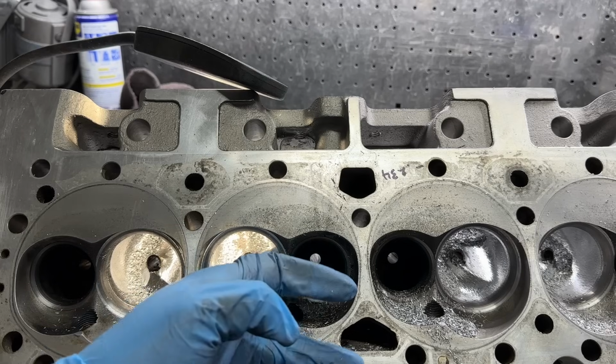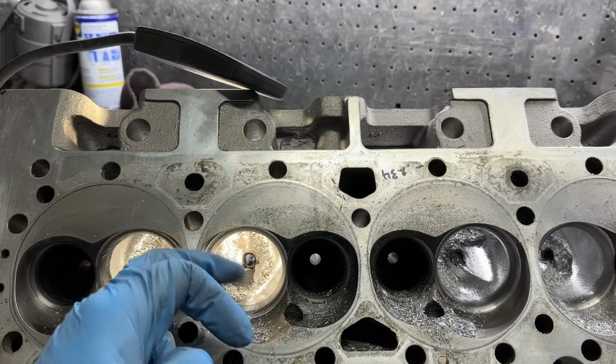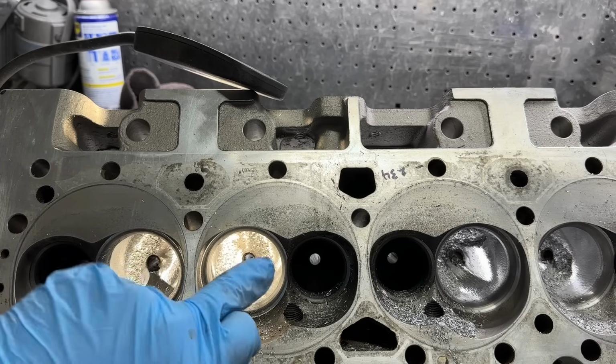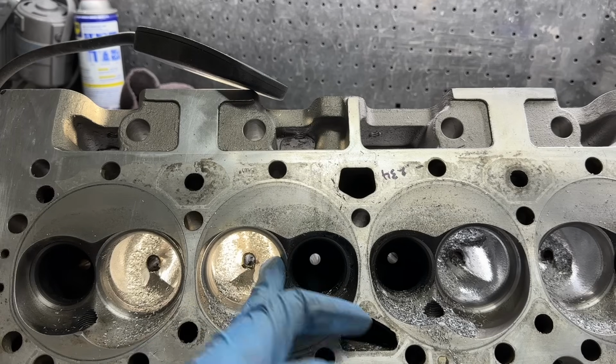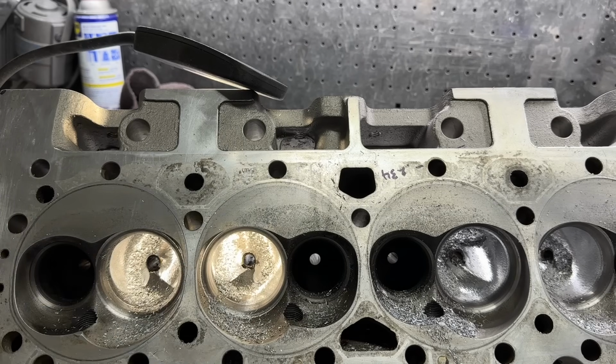That's essentially it. I'm not even close to being cut because I can feel it's squared. It needs to be rounded. And I'm starting again with this side instead of this side because this one's where I'm really taking more material. This one I'm rounding it. So I'm not really trying to remove so much from this side of the throat like I will from this one. Now, several of you are like, well, can't you just make it perfectly round instead of having an offset?